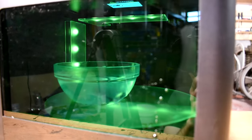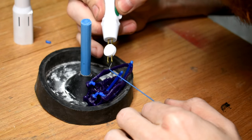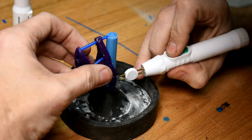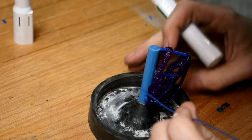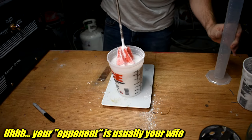With the skull being so long with thin sections, I'm spruing it up with multiple points for the metal to get in there. Sometimes you want that because you don't want the metal to have to travel all the way through these long little things, but I'm mainly doing it to hold the print up. This is kind of large jeweler's wax for spruing — it's not very tough, and if I just stuck one big sprue on there, the weight of the print would just break it right off. Don't mind all the dice — those are for a game. Metal dice are cool; it's always good to know you can throw them at your opponent if you're really angry, and they can cause damage. There's also another ring on there — maybe I'll finish that later.